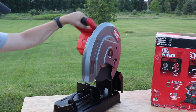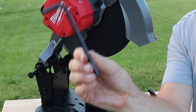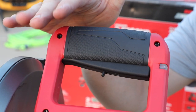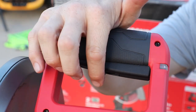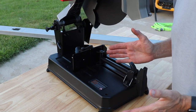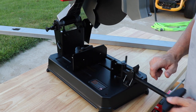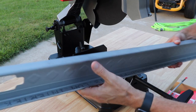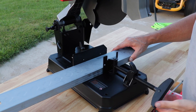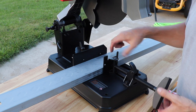There's a wrench for storage right on board the tool, which is always nice in case you need to make adjustments. There's also a nice safety feature — you can't just squeeze and pull the trigger, you have to flip that little lever over first and then squeeze it. When you want to start cutting, you pull this back, loosen that a little bit, release it, and then it can freely float back and forth. To secure your material, just put it in there, push it up tight, push that down, and twist until it snugs up.